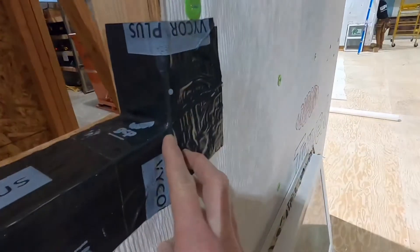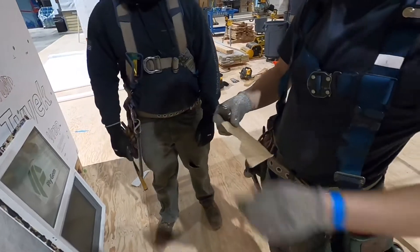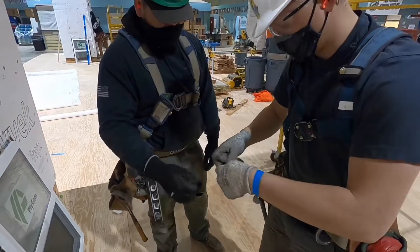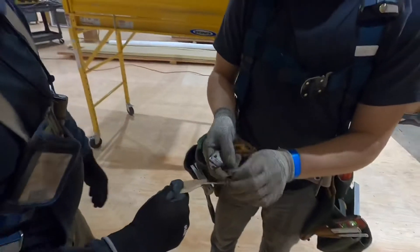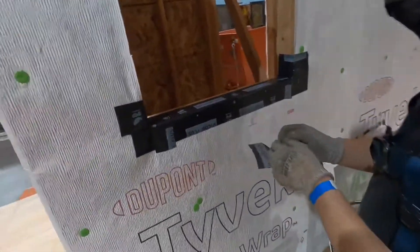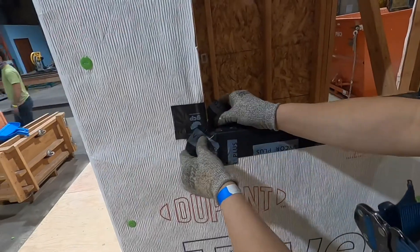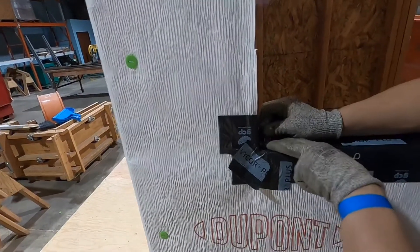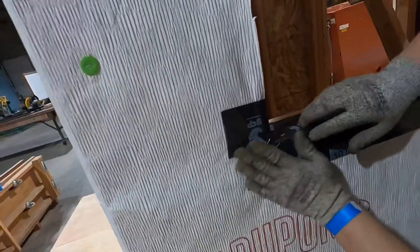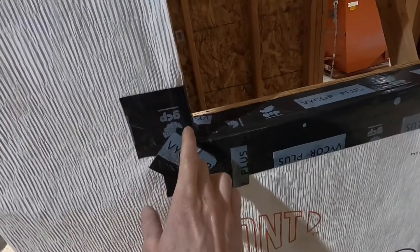That's how he stretched it right here — so it covers that corner really well. That's a bow tie. So ideally, planned ahead: you have your sill wrap, then your bow tie, and this piece over top of it. That way water coming down here hits a shingle-lapped joint. If there's a horizontal seam it's going to want to go in, so if this piece is under that piece, everything shingles correctly. Do this before that.